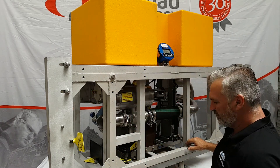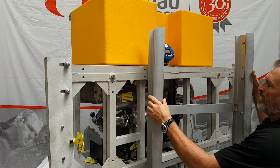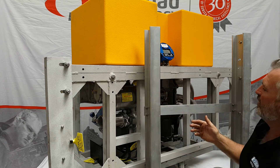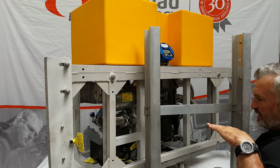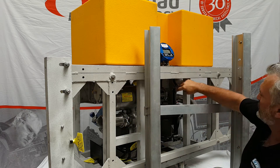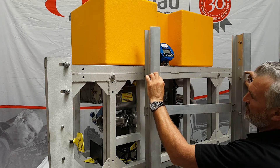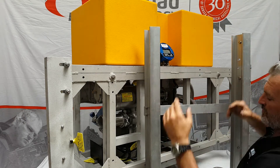This one is for the PERI XL series of ROV. For the UHD, we've also got another bracket which fits in the trays and the slots on the back of the ROV. There's a difference between the HD and the UHD in the dimensions, slightly. We've allowed for those adjustments within these brackets as well. So this simply slots into the back of the ROV. The Anchor Box frame then just sits on the back of this, and you'll drill these to wherever suits your ROV because there might be some slight differences — our frame is slotted to take up any variances. The Anchor Box frame will simply bolt to the top and away you go in the water, ready to go.